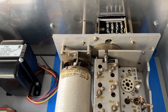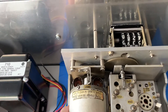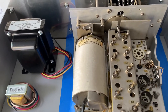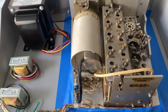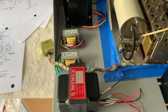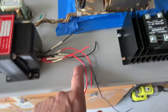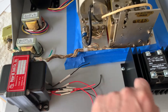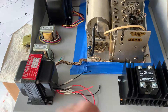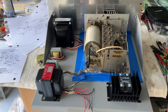I'm sure other people who have worked on these things have noticed the same thing — these gears, man, you take this thing out and it takes a while to move it around and get it so the gears don't bind on you. It's a pain, but they work good. These PTOs are extremely stable, especially since I'm going to regulate the filaments on both tubes in this thing. I need one more supply to power that up — a regulated six volts for those tubes. I just need to make sure the negative peak doesn't go down more than 90%. The new secondary baseline being generated will go through here and take care of that, so it doesn't turn the tube off when you modulate.